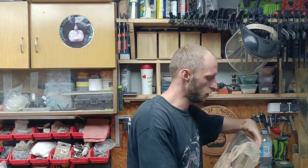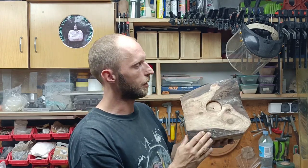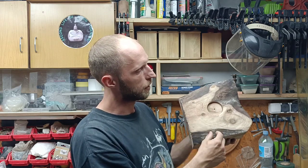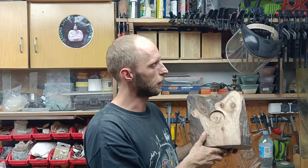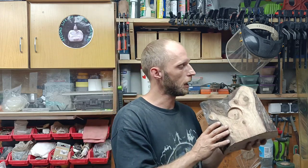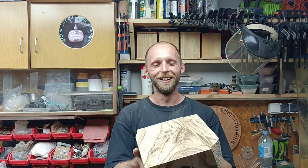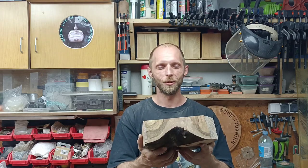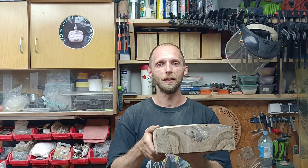What I will try to make is split the blank with two straps I will put here and here, and when it dries after gluing I will flip it and put two straps here. This should keep the blank in the correct place, and I will get 5 millimeters more of dimension. It's not too much, but always something. So let's go to the bandsaw and slice it.